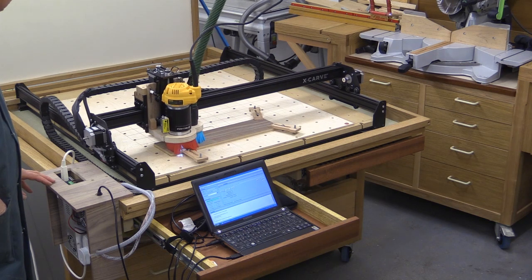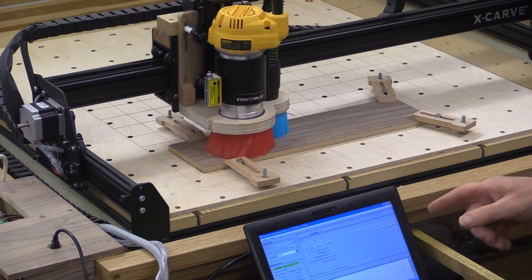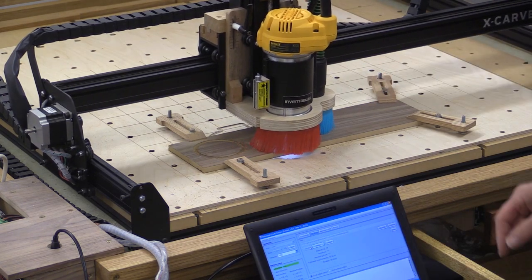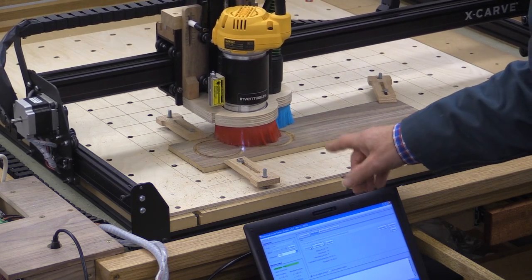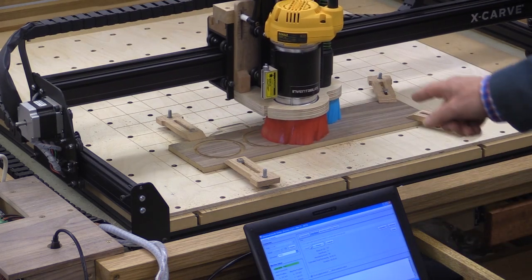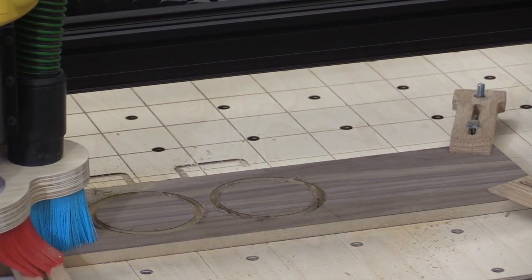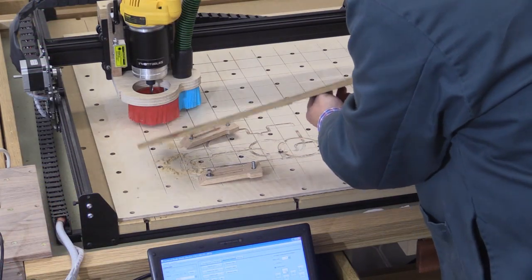We will be able to examine the quality of the cut both on the top veneered surface and on the bottom veneered surface. This is the first circle being done — this is the climb cut. And the second one is the conventional cut; you notice it's going around in a different direction. These circles have a diameter of 70 millimetres. And this final one is all the way through and it's a climb cut. That's it — job done.